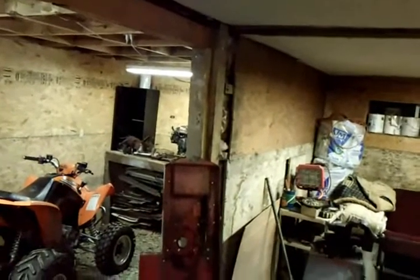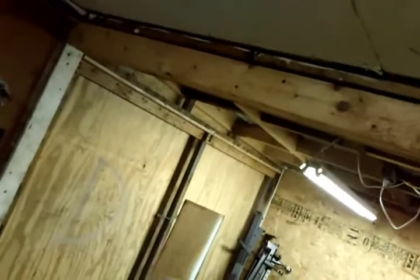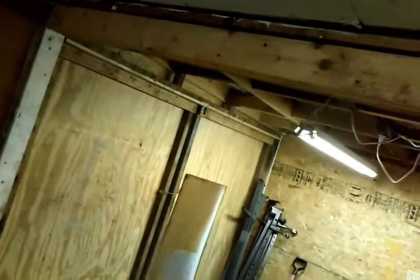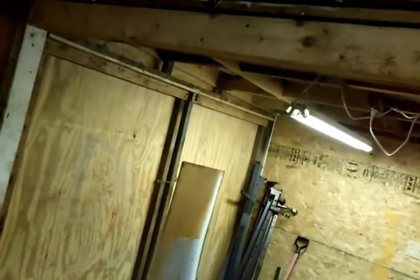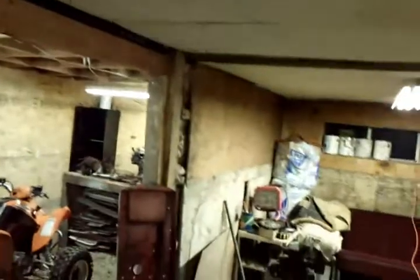If I want to open this up clear all the way back there, I will need, what is this, 25 feet long. I need a 25-foot, 1/4-inch thick square steel tubing, probably 4x4, where you run from here on top of that 2x4, take this post out, and run it clear across as a beam. And I don't have the money to buy a 4x4, 25-foot long, 1/4-inch square tubing. I don't have the money for it.